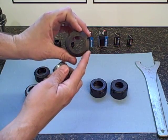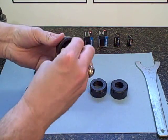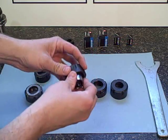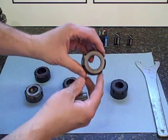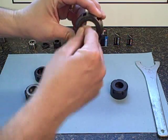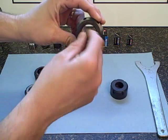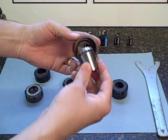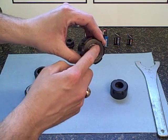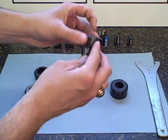The REGO-FIX standard is the high Q ER nut. These are designed to retain the collet once the collet is snapped in, as well as giving you the best balance options possible. They are available in friction bearing style. Again, even the friction bearing style locks the collet in, but be aware, when using a bearing nut, there is a slight length difference.